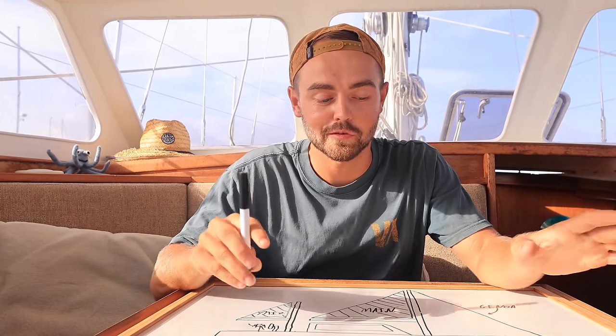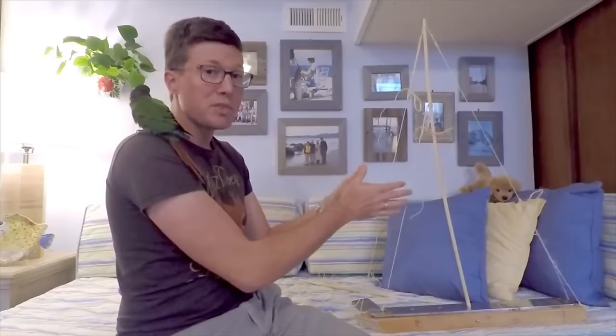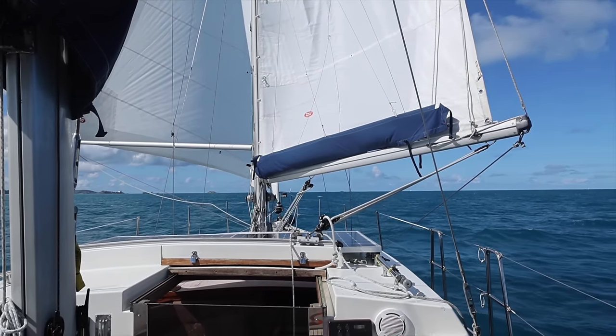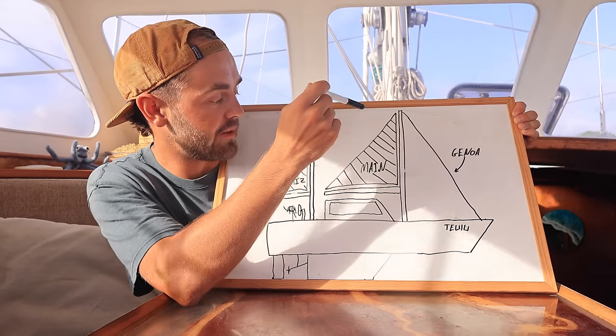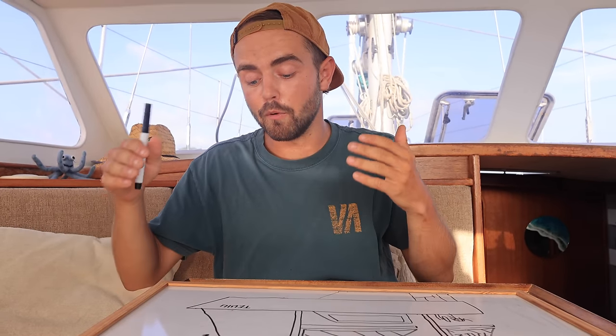Just a disclaimer: I'm not a trained rigger or sailboat maker, so take all this with a pinch of salt. I'll leave a link in the description to a video by a guy called The Rigging Doctor — he did a really good job explaining this, probably better than I'm going to do right now. So our problem is that at the moment, downwind sailing in Taley is good. We crossed the Atlantic absolutely fine and could carry on going around the rest of the world, but we think we can have a slightly better downwind sail setup. With our sails, we've got the Mizzen, Main, and Genoa. Going downwind, we tend to not have the Mizzen out at all — just the Main and Genoa. The more sail area you have to the bow of a boat, the more balanced it tends to be; instead of getting pushed, you're getting pulled through.